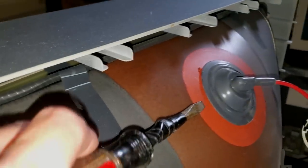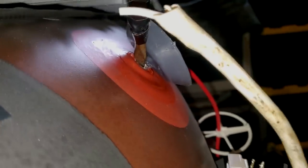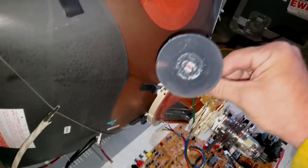Hopefully this video will help you decide if you want to get one of these televisions, or if you already have one, you'll be able to use this guide to get the best out of your Toshiba 24AF45. Before we go into the CRT I have to give you a big warning — this is the most dangerous CRT line I have ever worked on. There's a big chance you could take a real shock from the anode cap. Please make sure you watch this entire video before you open your Toshiba 24AF45. It may save your life.